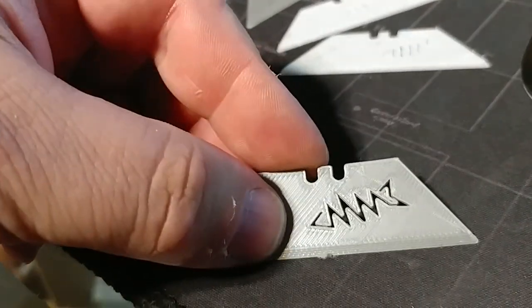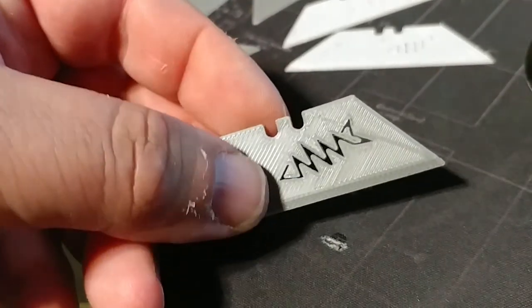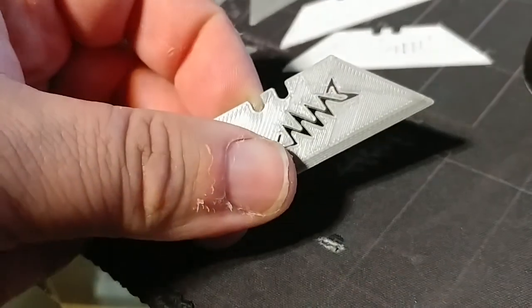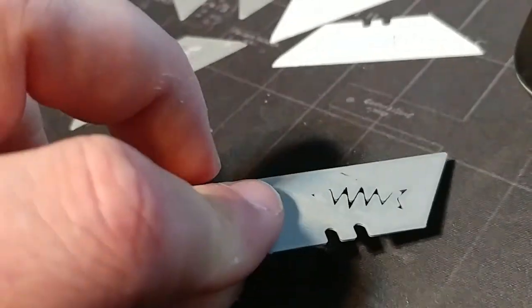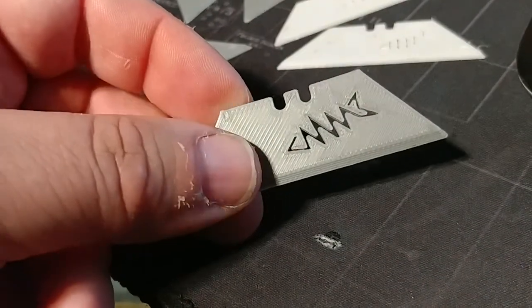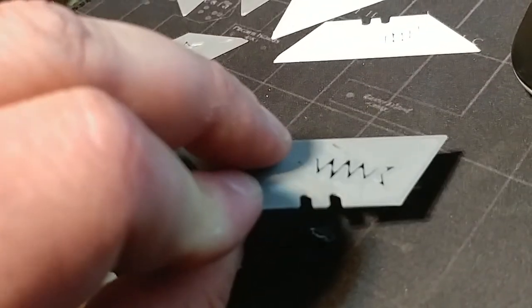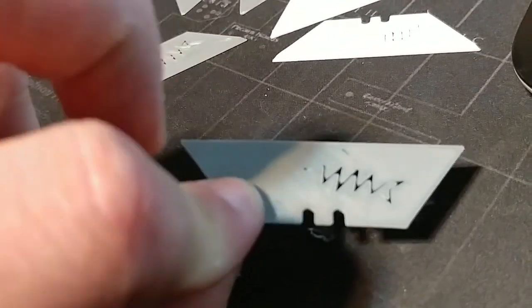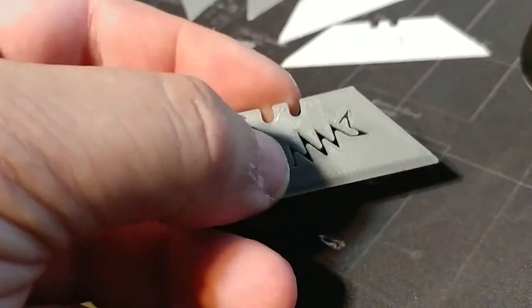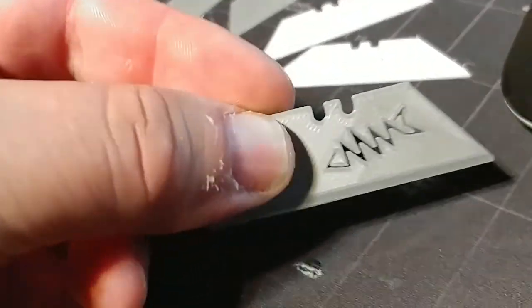But that's if you're just doing one for yourself or doing a couple for yourself. If you're mass producing them, that doesn't make sense. You would have to use a dual extruder, you know, a dark filament for the bottom layer and a light filament for the top layer. Or better, light filament silver for the bottom, then a layer of dark, and then the rest silver. This way it'll be silver on both sides, but you'll have that one layer of dark inside there giving you the depth for your cutout. Because obviously if you put this behind something different colored, it's harder to see the logo.